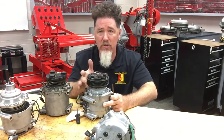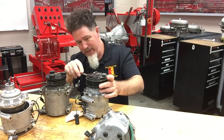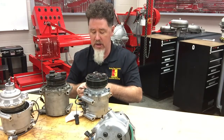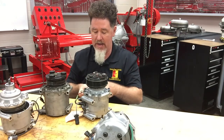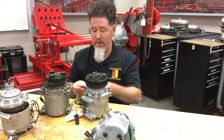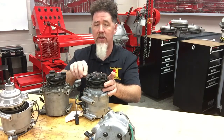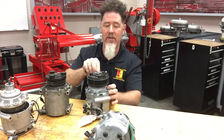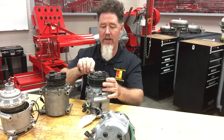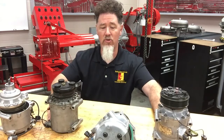This second compressor, since students took it apart, as I rotate it I do hear rubbing — the pulley is not running smooth, it's locked up. I try to get my 15 thousandths feeler gauge in there and there's no way it's going in. It could be a 1 or a 2 thousandths gap — it still rotates but the clearance is very tight. I'll try a 5 thousandths — okay, 5 thousandths does go in, so it's not totally locked up, but 5 thousandths is tight on one side and tighter on the other. There's definitely more than one problem with this particular scroll compressor.